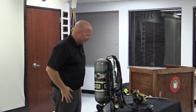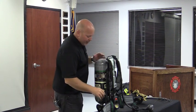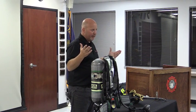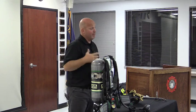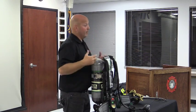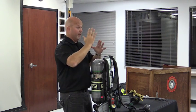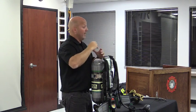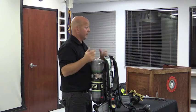So that's the electronics of the breathing apparatus. Going off of that, I didn't talk about the audible bell, but I think it was kind of intuitive for you folks, but I'll hit it real quick. Just like your current breathing apparatus, anytime you pressurize the SCBA, you should hear the audible bell. As you're pressurizing it, it should ring a few times and then stop. If you don't hear that, depressurize it and repressurize it. If it still doesn't ring, you do not use the SCBA. It's out of service.